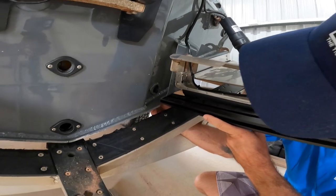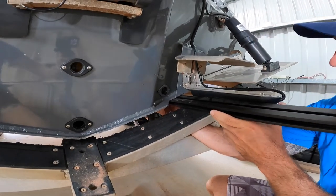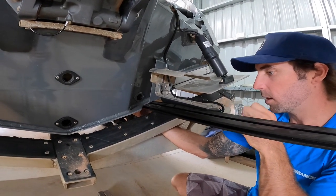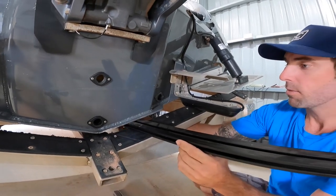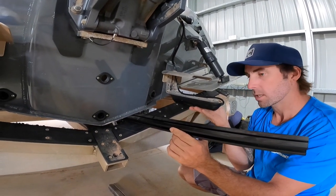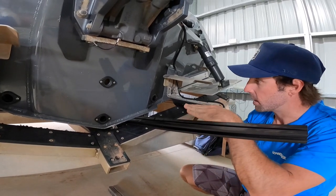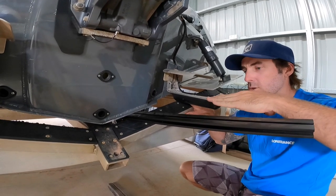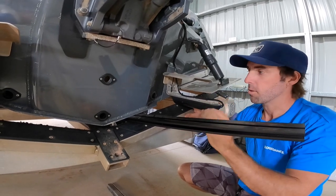You can see that transducer is around about there — possibly level with the keel of your boat. How I like to run it is around about here somewhere. The reason for that is when you have the water running underneath the bottom of your boat, it's getting nice clean water all the time. One thing you do have to remember when you have got it facing a little bit forward — you'll get a nice clear picture, but when you pull up your transducer is ever so slightly going to be facing forward, so you just have to remember that part.